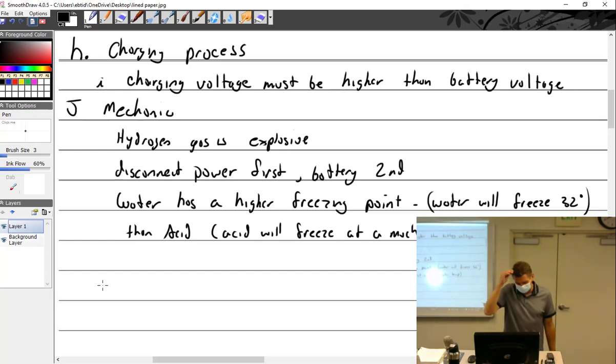All right. So when you're doing that, number one, always wear safety glasses around a battery. We talked about removing the negative side first, and installing the negative side last when installing. Don't short circuit a battery, because how many amps are in a battery? A lot.